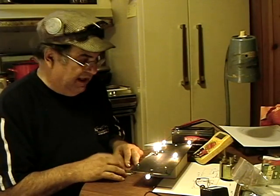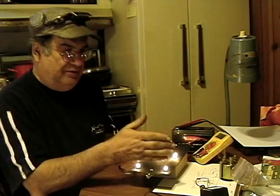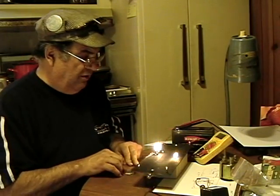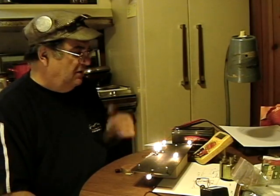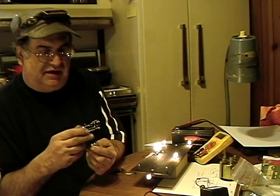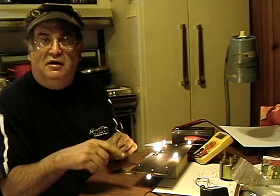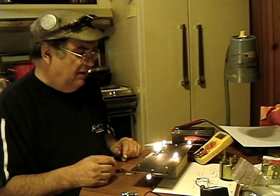Back to center, then the first switch off to the left: markers on again, backup light comes on, front markers — so now we can have reverse movement. Either way, you have seven bulbs powered, and the meter is showing 11.72 volts after four hours of operation. For the connectors I chose to use microphone plugs — I understand they're used for CB — with four conductors. I need three plus a ground, because I want to ground the locomotive separately with a hard ground rather than use the drawbar.